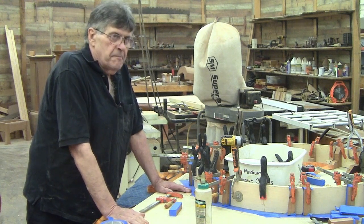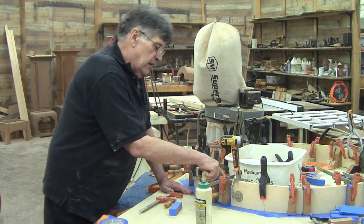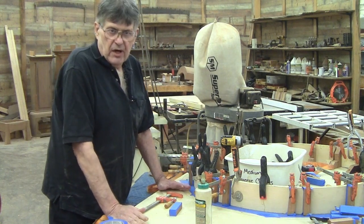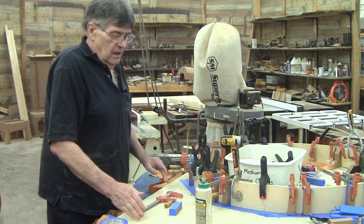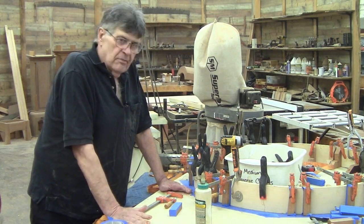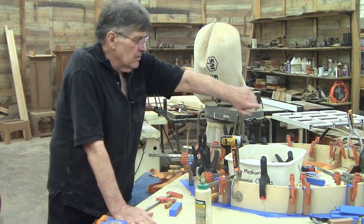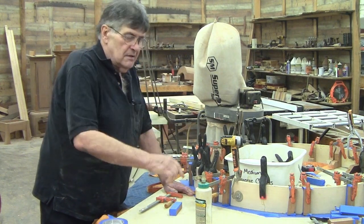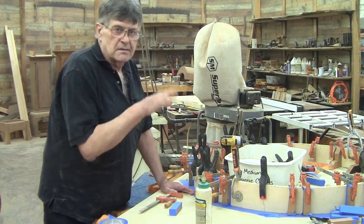But again, I'm convinced that the easiest way to do it, and where this comes from, is once we had the first two layers on and not having to try to deal with those seams per se, you understand where we're trying to pull seam and the next layer and all that. So when I do the 5 foot one, I'm going to do what I initially thought about. And that is take a piece of plywood and go around the cauls and just screw it down. Put tape around it so that I can just do the half bands and use the blocks. Done.